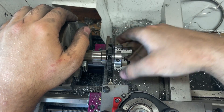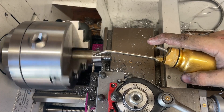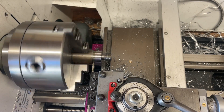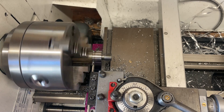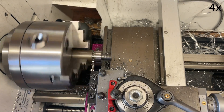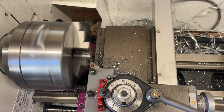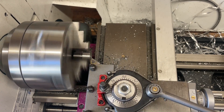You could obviously make a nicer thread with the right cutting tool rather than something ground in five minutes. Then I cut the part off - I had figured out from last time that my cutoff tool wasn't working, and I found the reason here: I hadn't changed the belt, so I was running it way too fast. Running it at 120 RPM it cut off just fine. I was just running it way too fast before. And with that we're done for this week - I hope you enjoyed it, please like the video, and we'll hopefully finish this project next week. Thanks for watching!